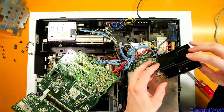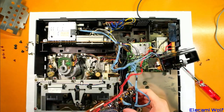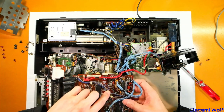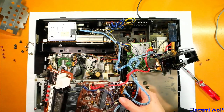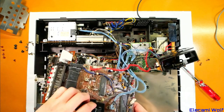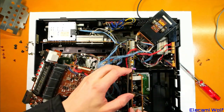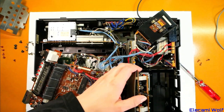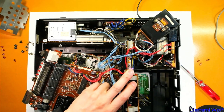There is some cap leakage there. There's corrosion visible on that jumper there, so some capacitor has leaked. Must be that little one. One of the super caps has been cut off, so I guess that was leaking. That's not a good sign. This board here doesn't exist in the NV370 — I guess this will be the HiFi audio board. That makes sense as the thing the non-HiFi version doesn't have.